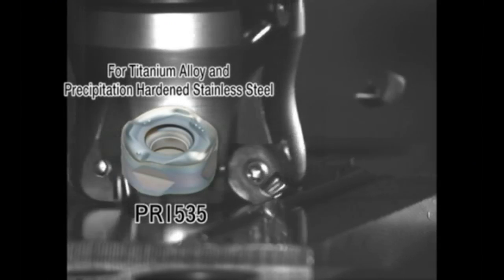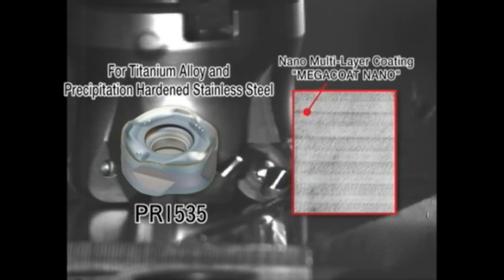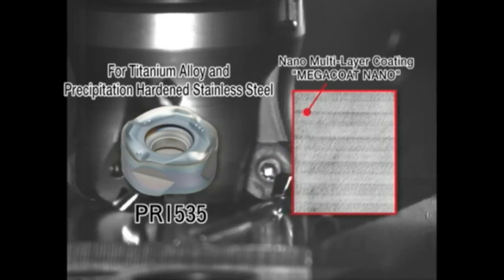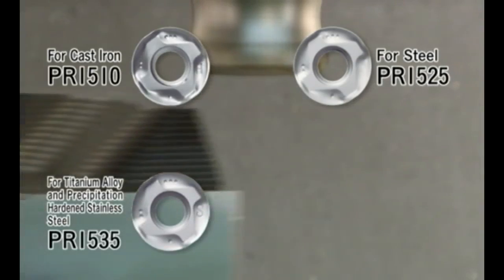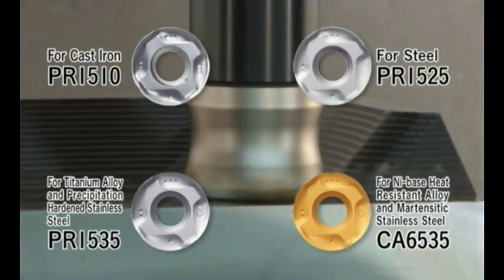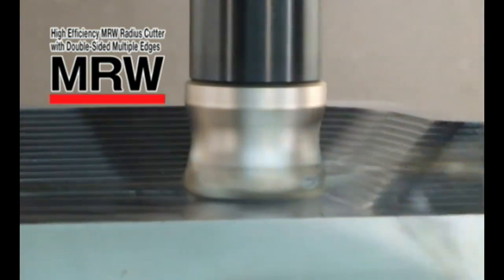The new PVD-coated grade PR1535 is suitable for titanium alloys and precipitation-hardened stainless steel. PR1535 provides longer tool life and stable machining due to Megacoat Nano. The MRW is suitable for various workpiece materials with 4 insert grades: PR1510, PR1525, PR1535, and CA6535. The high-efficiency Radius Cutter MRW with double-sided multi-edge inserts improves milling dramatically.